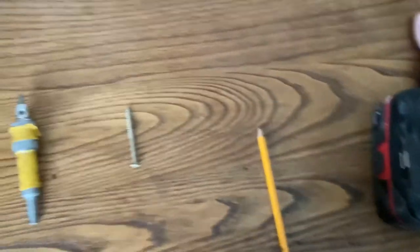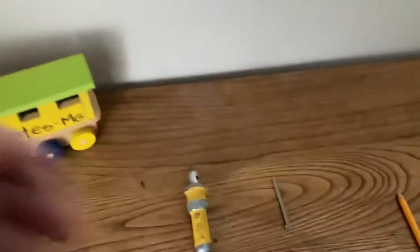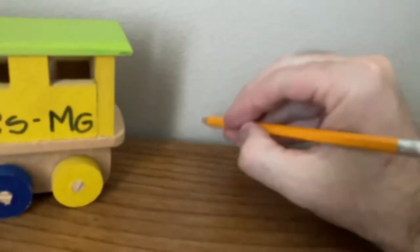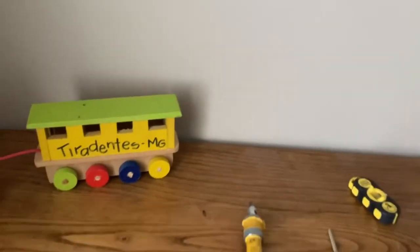What I'm going to do here is push the dresser back against the wall. I had already marked my stud right there, so I'll mark that a little more clearly. That's the stud location, more or less. You've got about an inch and a half of play — it's a two-by-four back there with the two-inch side facing you, but it's actually an inch and a half in reality. I'm kind of eyeballing it, though you could measure from the wall too.